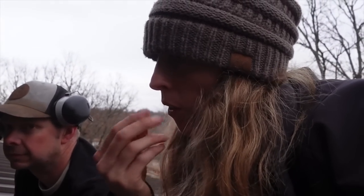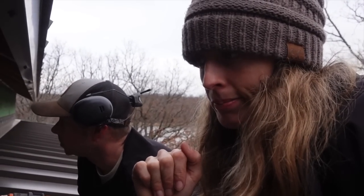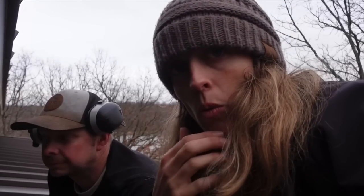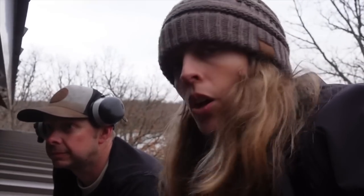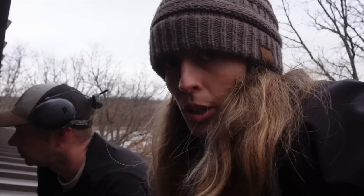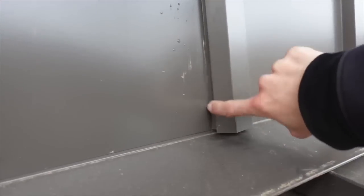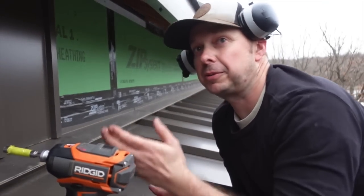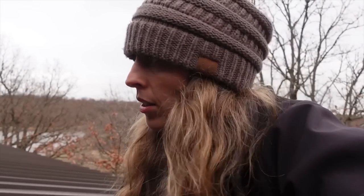We have problems again — of course the easy part is going to be screwed up. They didn't roll the metal right again. We had that same problem on the long window wall where the first rib on each piece was smaller than the rest. So it doesn't fit over properly, and it's happening again on every single panel — you can clearly see it sticking out. That's the cap side, which should be smaller, but it's bigger. We're going to have a problem all the way down. Since it's up high and hopefully not visible from the driveway, we're just going to go with it.